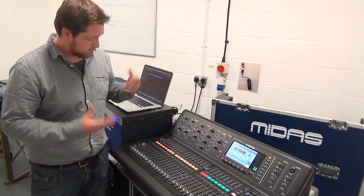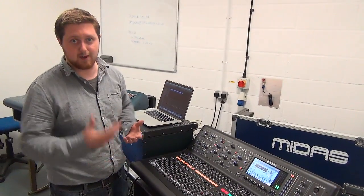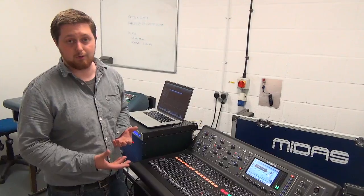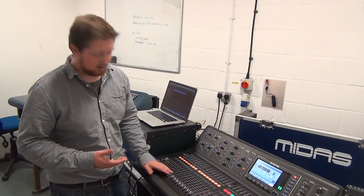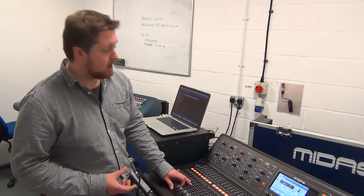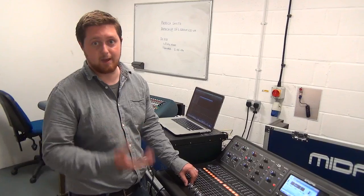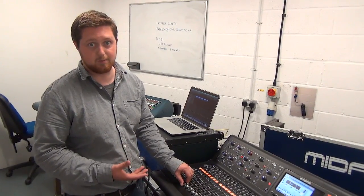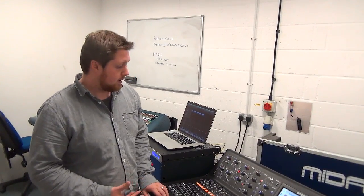So what's changed? Well, the answer is everything else. All the hardware here is Midas hardware — a new Midas design chassis, all the faders, all the encoders are Midas designed. It has a much more rugged, durable, professional-end feel to it. We've got a lot of features borrowed from the pro series consoles, which are very much an industry standard now. We have the pro series fader here, a full 100mm fader rather than the shorter fader on the X32. All the preamps on the console are fully featured Midas pro series preamps, so there's a real audio benefit over the X32.